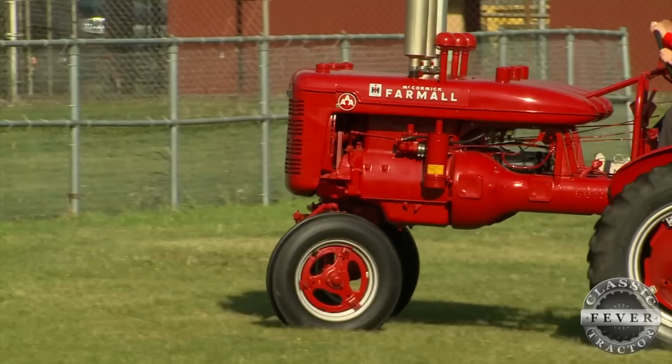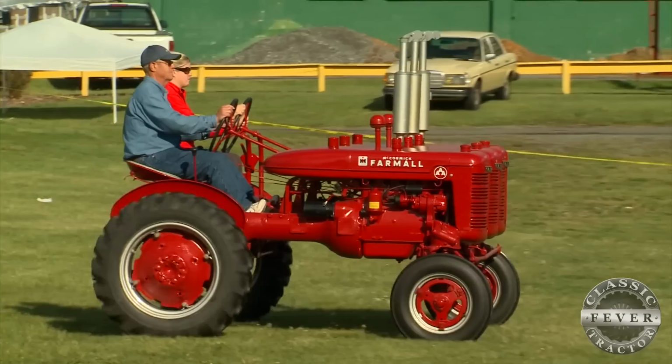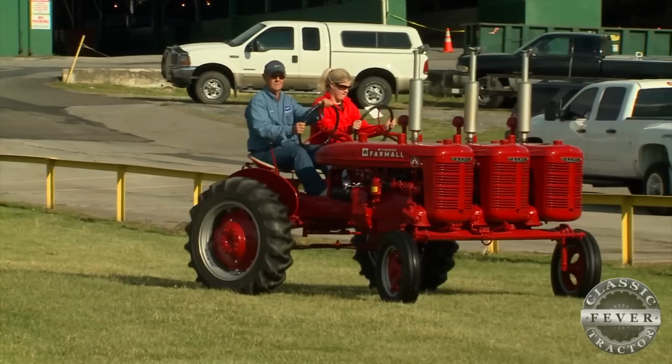And how about the steering? What kind of challenges did you have in doing the steering? Basically, I just had to elongate the front axle, make it longer, do some bracing, didn't change the pivot point. It all still runs basically off the center engine steering. The other two steerings are just fabricated to fit.